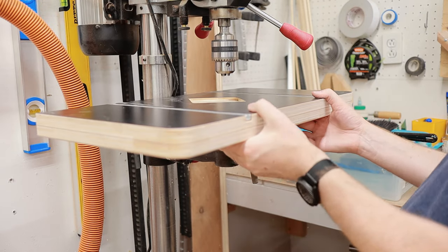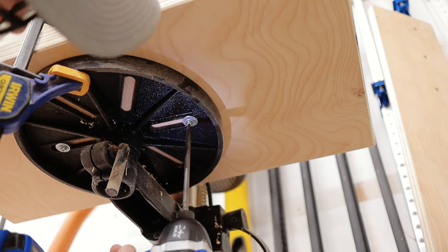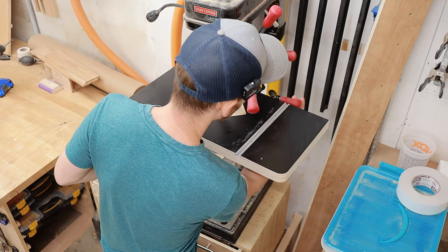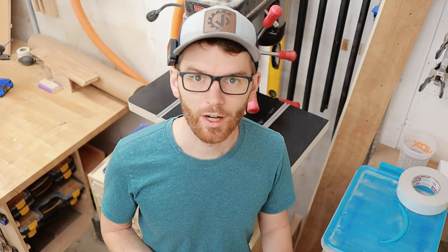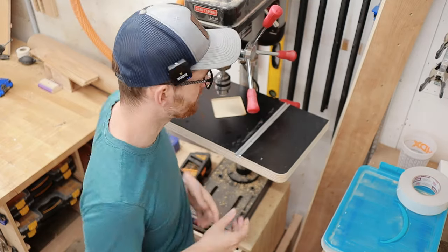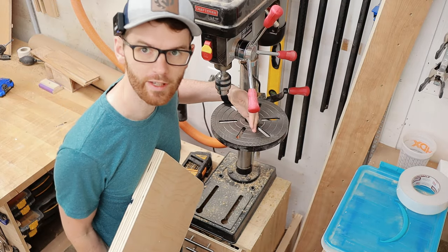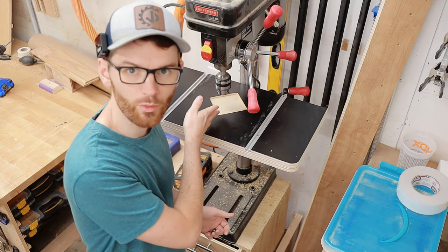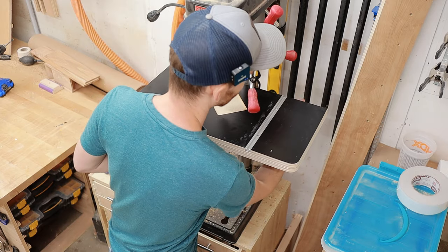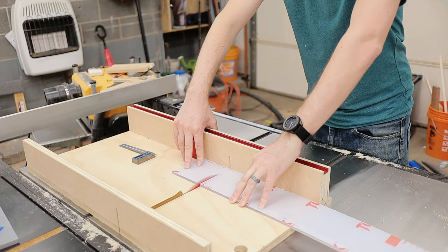The next step is to install the table onto the drill press. But here's the thing — depending on how your drill press is set up, the crank to raise and lower the table might actually hit the tabletop that you just made, which would be a real bummer. Good news is, if you made that mistake, I have a solution: turn the table to 45 degrees from center, then install this table on top so that your cutout is centered with the spindle. Problem solved — the crank doesn't hit your new drill press table. We'll get to why that was a dumb fix later.